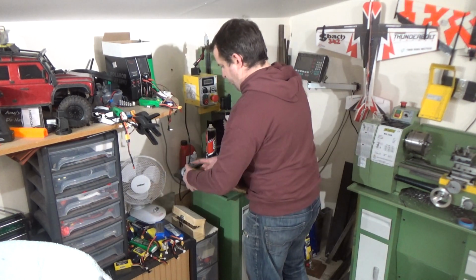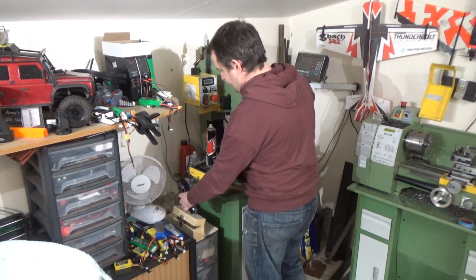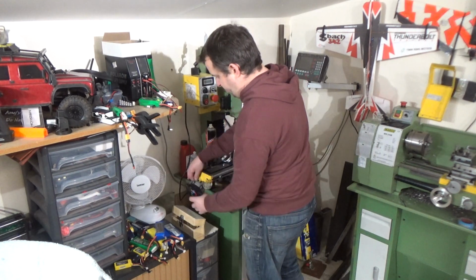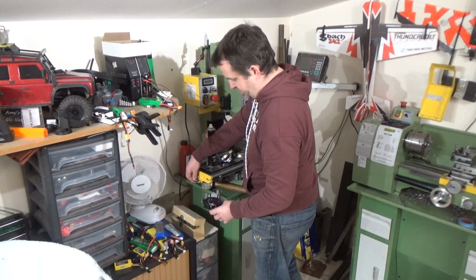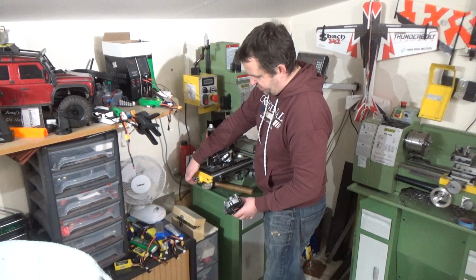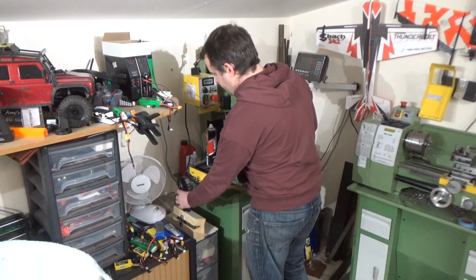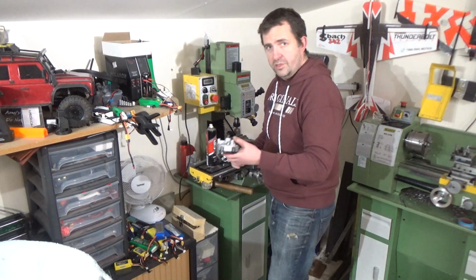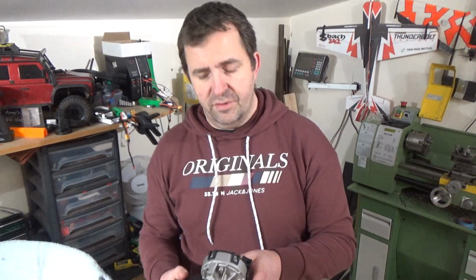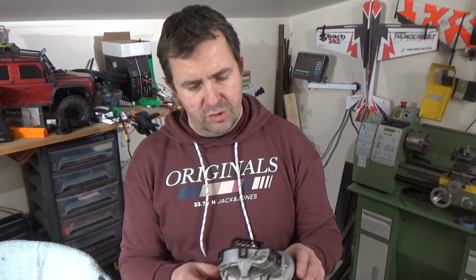But probably going to hang it down. Don't know. I've got 3 bolt holes to pick up on. Some sort of plate. Might just do a collar and a little dog that engages into the little one there. So it wants to be quite sturdy because obviously potentially there's going to be a lot of force. If you're milling, doing a face mill or something, you could have a little bit of force on it, so it wants to be quite good.